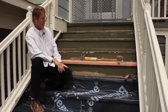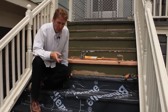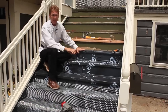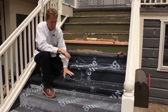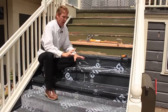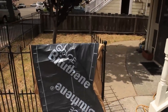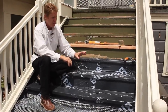So what I told him is next year, when you see this cupping, we'll replace it and do to yours what we did to mine. What Jason is doing — Jason's actually doing all this work, I'm just going to explain it — we've got a membrane. I told him go pick up the best membrane you could find, a peel-and-stick, and he came back with this. It's a good membrane, it's for shower pans and decks. Jay already spent about three hours just putting on this peel-and-stick. It's a hot day and if it's hot, it sticks to itself — it's a nightmare to put on.